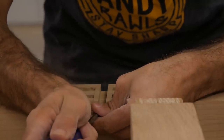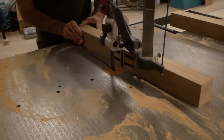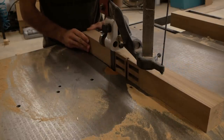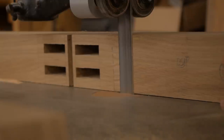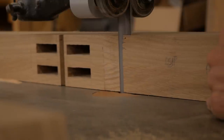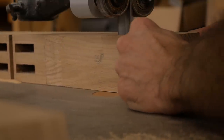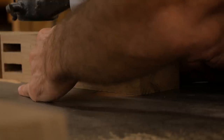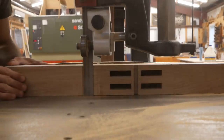The joinery is all cut, so now I start shaping parts. There's not a lot of shaping on this table — mostly straight lines. I've got a taper on the foot and the support for the tabletop, cut on the bandsaw. When you cut tapers on a bandsaw, always start going into your cut — don't start on the end and come out of the taper, it always jumps. Starting this way gives you a nice smooth transition into the workpiece.